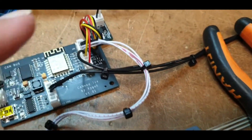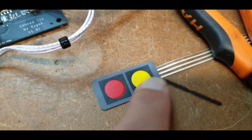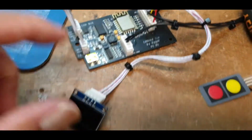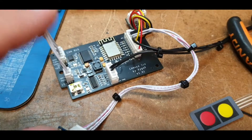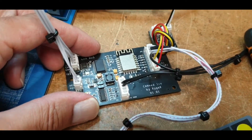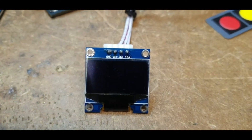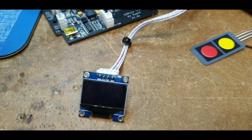I've got a couple of buttons connected: the yellow for a soft reset and the red for a hard reset — I'll be providing these with the kits. What we're finding is when you power it up, after a couple of seconds you just press the yellow button, the little blue light on the ESP flashes, and then it boots up. These are firmware-updatable, so if we figure out what's going wrong with boot-up, we can push a firmware update wirelessly. We've also got the little OLED display, which is great — if your computer isn't attached, this display will tell you everything that's going on.